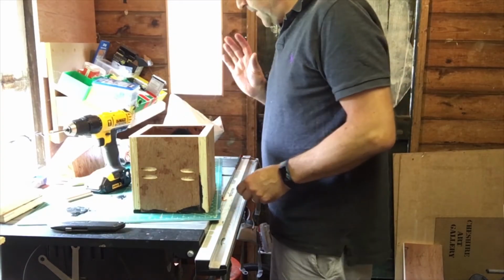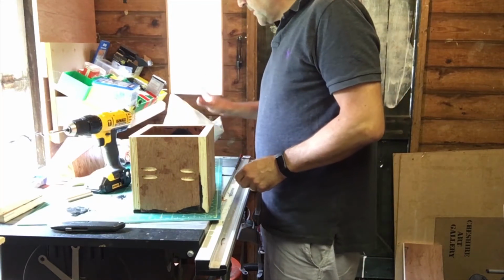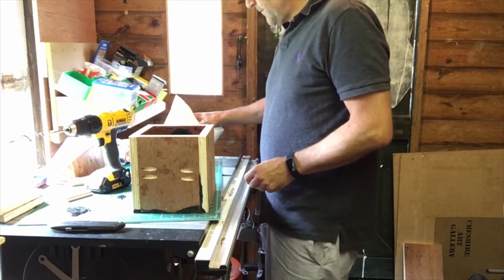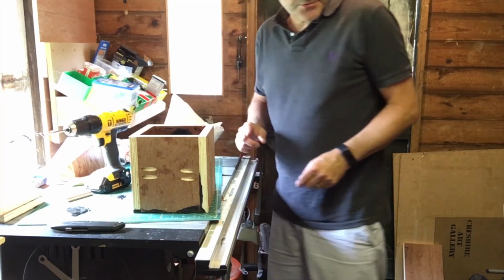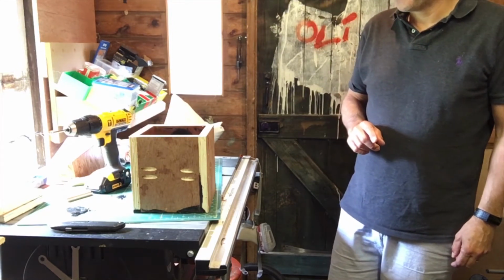I'm going to go for 500 grams, starting off with 100 grams of the glass beads and 200 of each of my 2 parts of the silicone. Wish me luck.